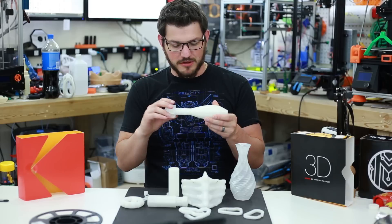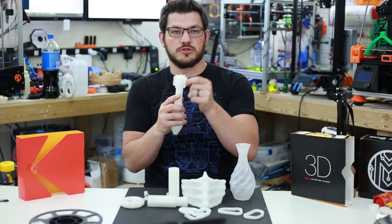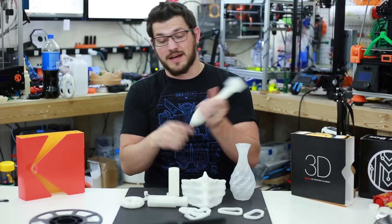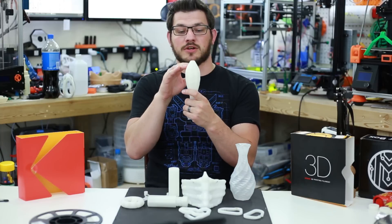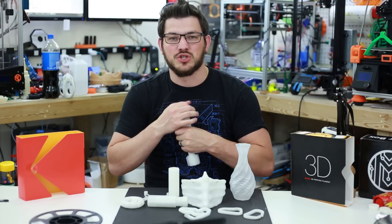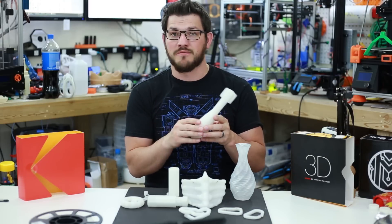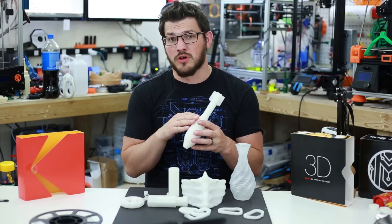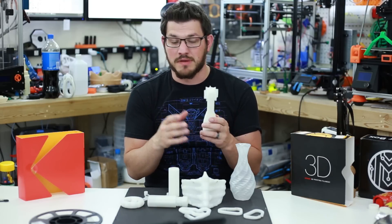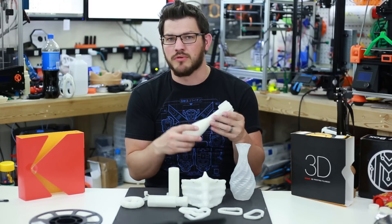Lastly, I printed this bomb — the 50mm German mortar. I've printed this in PETG before. The bottom did warp; it has these very small single-extrusion fins that peeled up. Otherwise it came out pretty well. I printed it with support inside for the nose cone, but because the whole print warped, the main body and tail don't quite screw together properly. And because it's nylon it's so smooth I can't get a grip on it. I also noticed the retractions were off because I printed all three parts on the bed at once — there's some beading on the side. I'll up my retraction about a millimeter to a millimeter and a half to solve this.